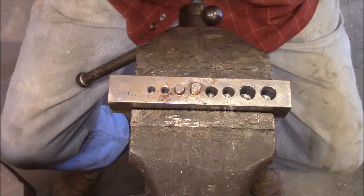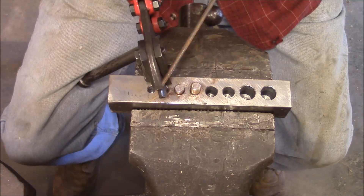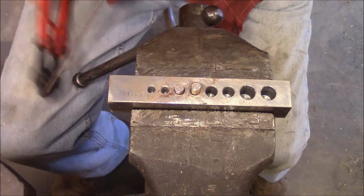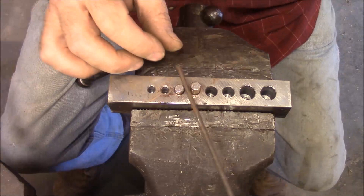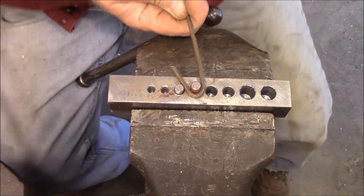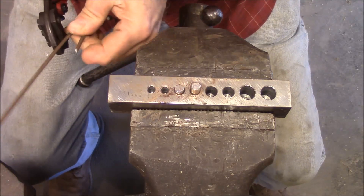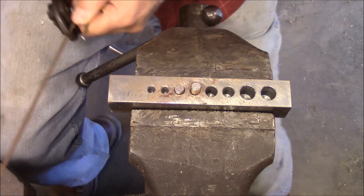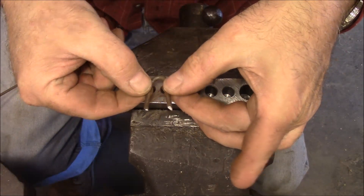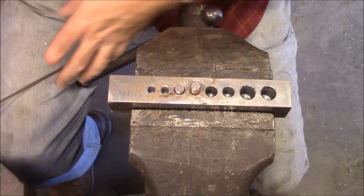Just take this and set your wire down in there. Take the bolt cutters and hold it at an angle like that and nip that off. So now it's kind of sharp. Then bend it, and cut the other side off at a sharp angle again. I didn't get that one at a very sharp angle, but you could also grind that to a sharper point. Then you just hammer that in. So that's got that one done, and we've also got this eye done here.